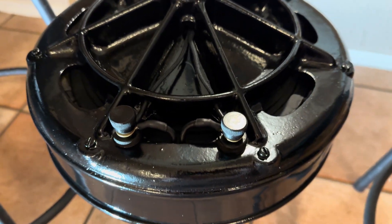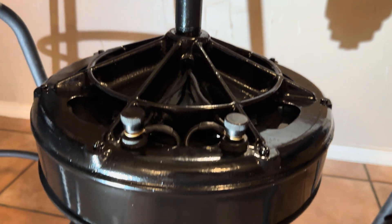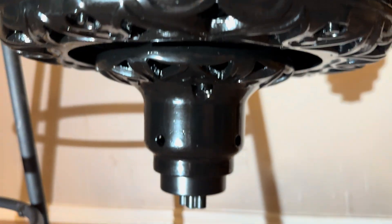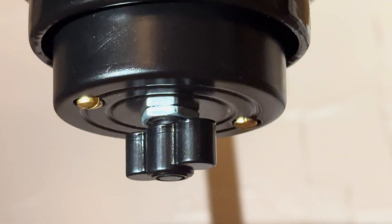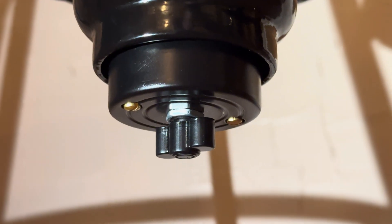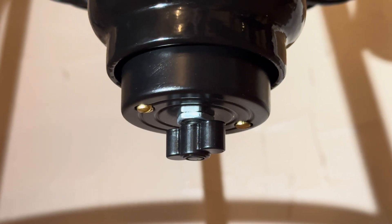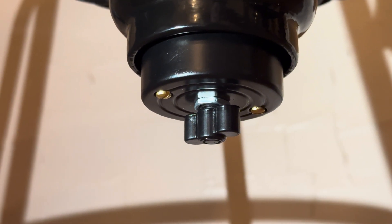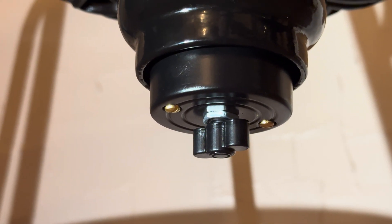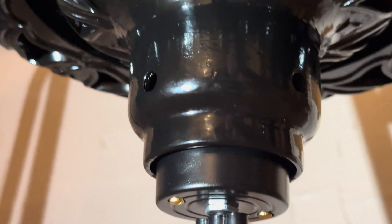You can see the stator is connected to the terminal nuts up here — one of these is the neutral and one goes down to the speed coil and the switch. The switch is a 3D printed replica of an original snap switch; the original one was broken, so that's a modern switch within a 3D printed housing.